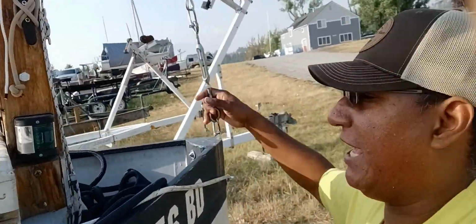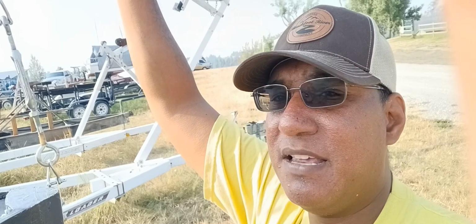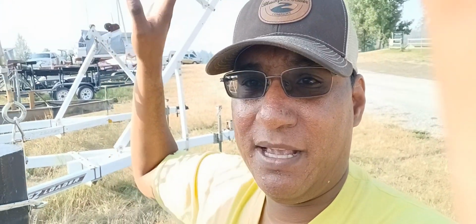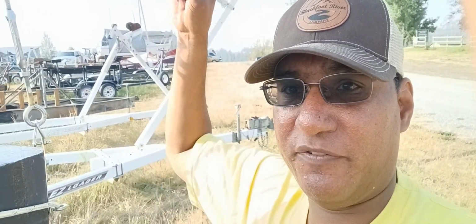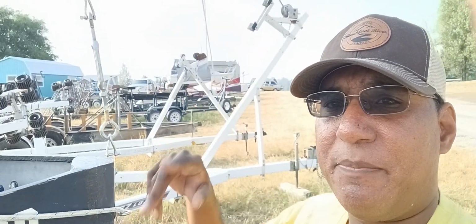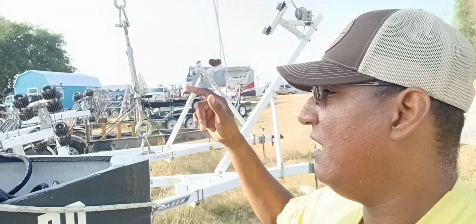I did get my forestay, and I had it made here. The problem is that the fitting at the top of the mast, I've tried 3 different ones, all through bolts. They're all bending. I managed to start bending and opening up a non-forged one. So I've got a forged one up there now, but even that is starting to bend. So we're going to go to a different fitting. I've got to get ready today, drop the mast, get that ready to be put in.